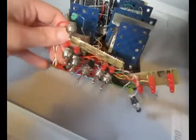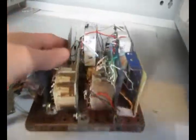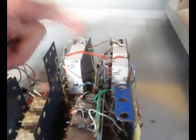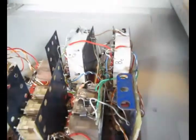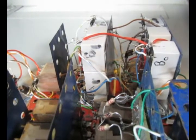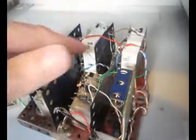Of course this is still old front panel stuff, and this is gonna be removed. These are the 2 adder-subtractors, for the least significant bit and most significant bit. And of course I'm gonna add another 2, probably with different relays, cause I'll need enough of the same relays to build the 4 adder-subtractor units.